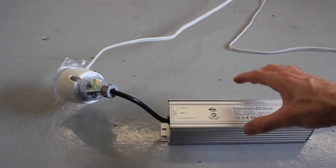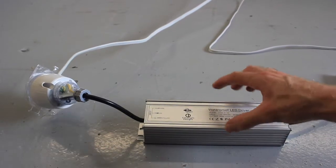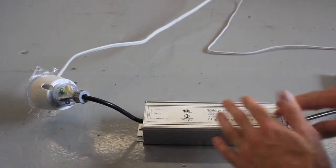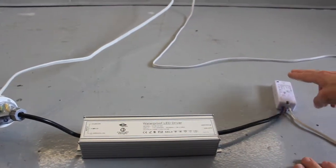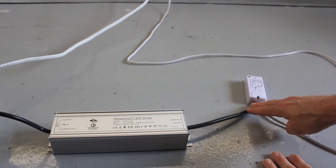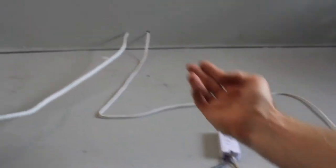For a mirror this particular size we have a 150-watt driver, but the driver size will depend on the size of the mirror. It converts 240 volts into 12 volts that runs into a dimmer receiver if you have a dimmer; if not, the 12-volt driver runs directly into the 12-volt lead. That 12-volt lead runs through the wall cavity and comes out through the centre of the mirror. You can locate the driver either underneath the vanity or in the ceiling.